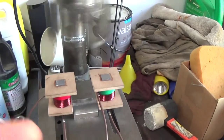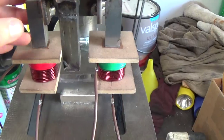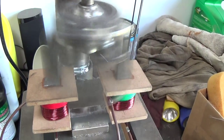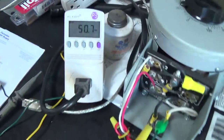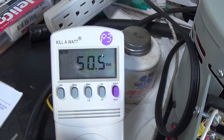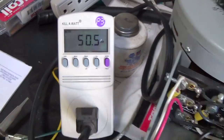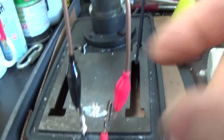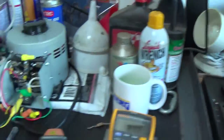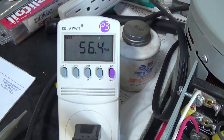So now I'm going to bring the cores back to it and we'll continue. The cores are in position now, I'll give it a start. So right now both coils are open and I have my volt meter here across the 1 ohm resistor. If we look at our power it's pretty well 50 and a half watts in that position. And if I put my 1 ohm load on just this single coil without shorting the other one, we're looking at 56 and a half watts.